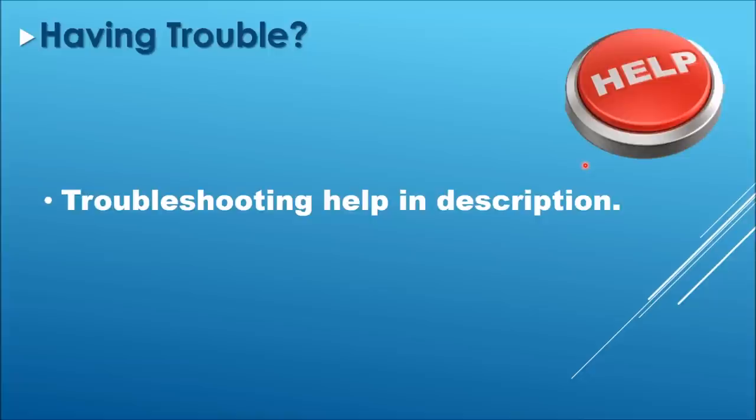Some of the most common problems are going to be, like I mentioned earlier, multipath. Short delay multipath is going to be your biggest enemy. If you're experiencing that, try moving the antenna, re-aiming it, getting it away from metal objects. First of all, try that. If that isn't doing it for you, try plugging into a different TV and taking your network out of the equation. Run one cable from the antenna to your TV, taking everything else out, just so you can verify that your TV tuner isn't bad. If you're still experiencing issues, maybe try a different TV just to verify that your tuner isn't the issue.